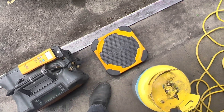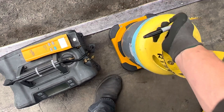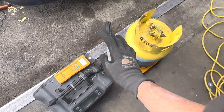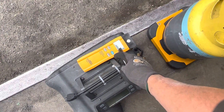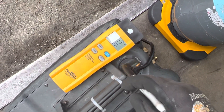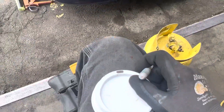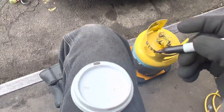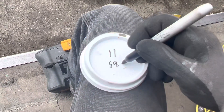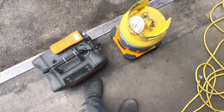Right now we're recovering, not charging. We want to know the weight of the empty tank with nothing attached. The refrigerant inside is sloshing back and forth, so you'll see the number moving — it's roughly 11 kilograms 590 grams. I'm going to write that down and save that number for later to find out what the final weight is: 11,590.